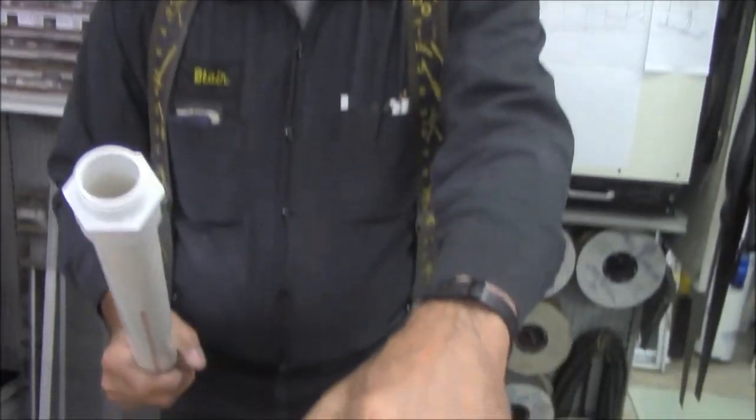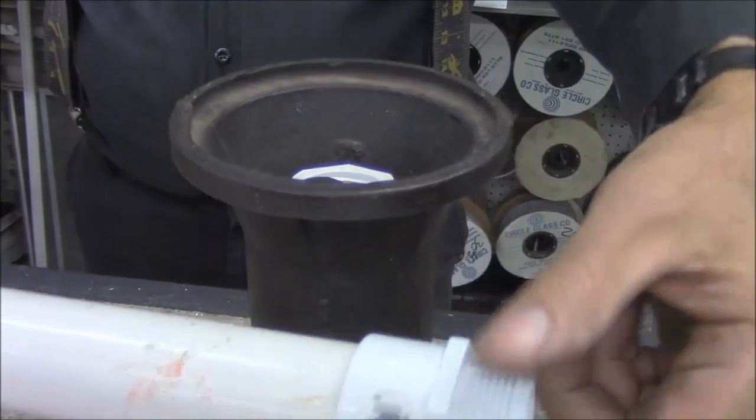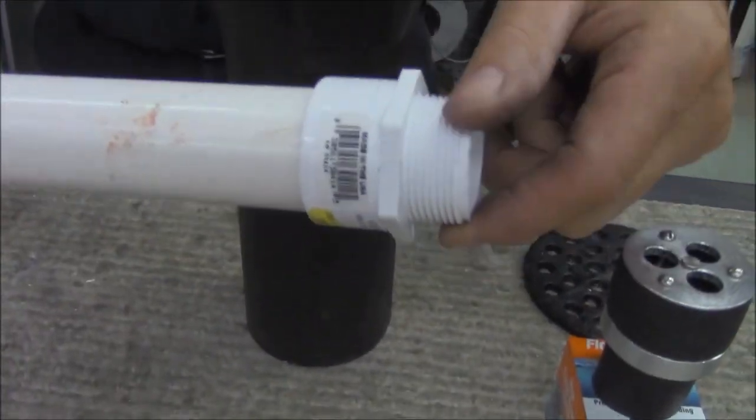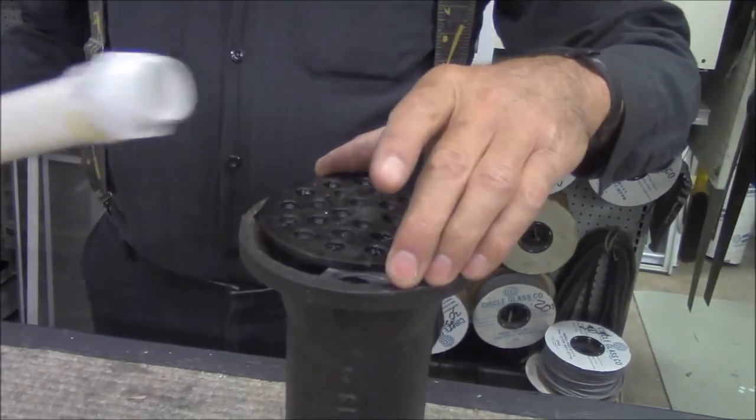It's going to rain this weekend. It's got 1¼ threads in it. You take a piece of 1¼ PVC that's already got a male adapter glued onto it. Our floor drain is still a floor drain — so if our hot water tank blows up or the washing machine blows up, water can drain and go out of our house, and our basement isn't going to flood from an internal disaster.